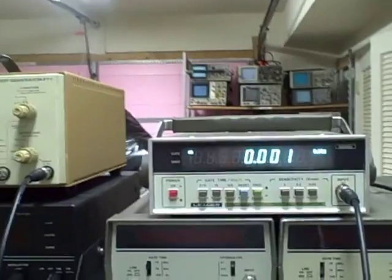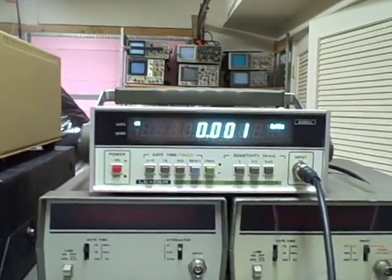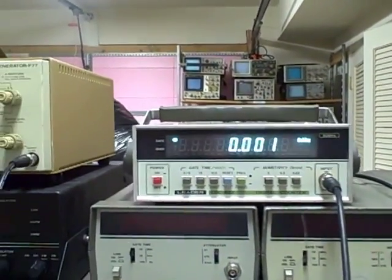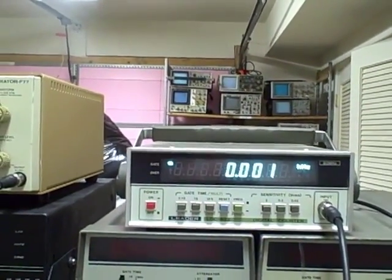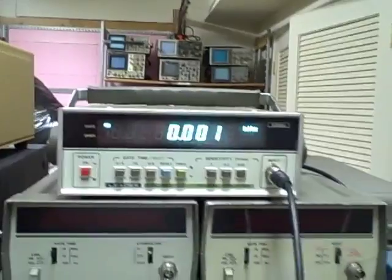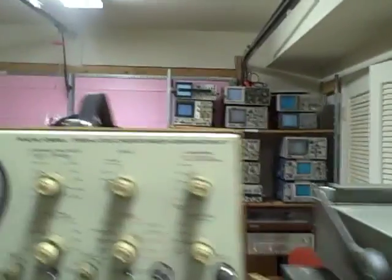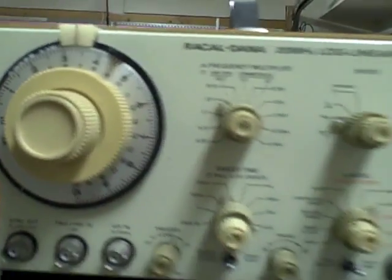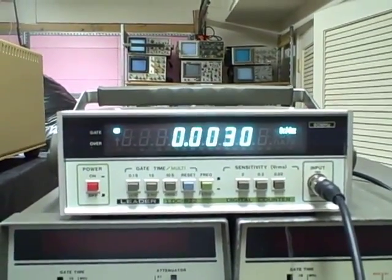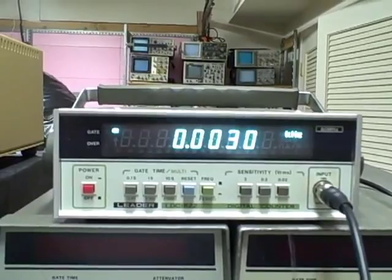The unit is capable of reading all the way down to a hertz, and that's in the frequency mode. For the low end, you're probably better off measuring period, because there are more cycles — count cycles in a period. You can take 1 second and break it up into 100,000 counts, so for a 1 cycle, 1 second period, you'll get some nice resolution. We've got ourselves set up to measure period. Right now we're feeding in a signal that's approximately 3 hertz, and we are reading frequency at the moment on the 10 second time period. We see that we have .0030 kilohertz, so that would be 3.0 hertz.